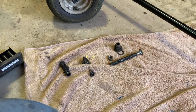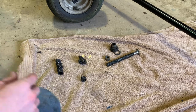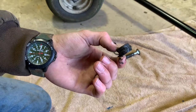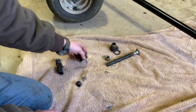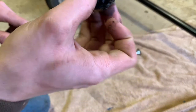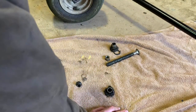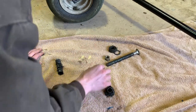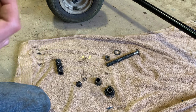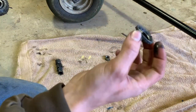The thing's laid out on a towel here — I'm not over in the shop right now, I'm just over in the barn. That's where the Grasshopper lives. I think I figured out part of our problem. That's the inner part of a bearing, and there is the other half — the balls are in there. The ball bearing just decided to blow up. They were in plenty of grease — they just decided to fall apart, and that caused the rest of the machine to fall apart. And there are shims here, just more like big washers.